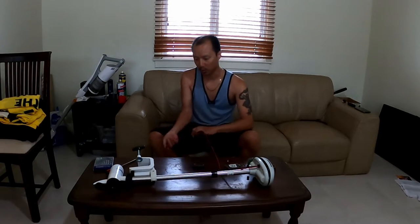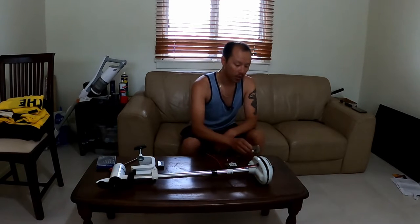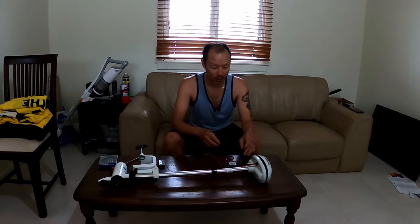That way, once I plug the Watersnake up to my battery, not only is it going to tell me the remaining voltage of the battery and the percentage of power left, so I can keep an eye on my power, but also I'll have this 20 amp PWM controller that will allow me to modulate the speed of the Watersnake.